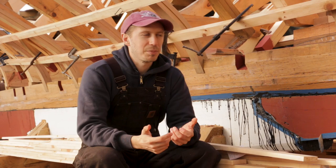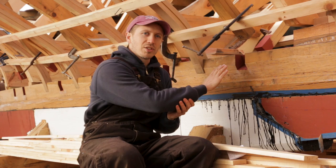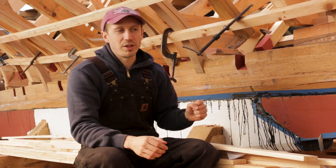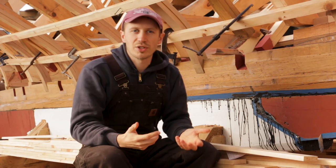Once we were ready, we added another 20 minutes and the next frame came out. What you do is put them down into the frame sockets. We had one more issue to figure out: how to keep the bottom of the frame socket from kicking out when it starts to bend in. We had Ross, Wes, and Bob figure out a system where a piece of wood would sit up against the bottom of the frame, and we ratcheted that down to keep the bottom of the frame in the socket. We needed to make sure the frame was all the way down, and then it was crucial to move as fast as possible — basically, once it's cooled, it's not bending. Once everything was in place, we got a couple pieces of webbing in through the ribbands, everybody started pulling on those, and since the frame was softened, it basically takes the shape of all the outside of those ribbands. That's how you get your steam bent frame.